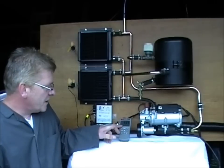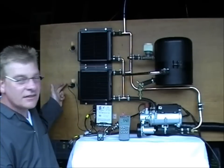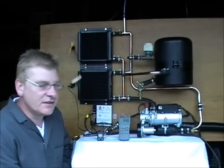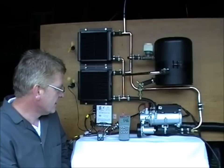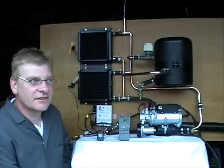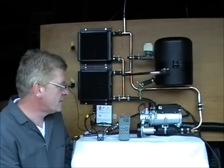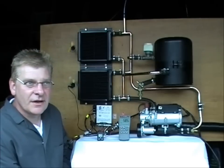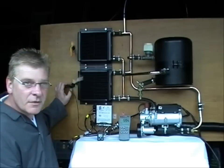You probably can't see this figure, but at the moment we're up to 54 degrees of hot air being sent out in these little heat exchangers. The heater has now gone back into boost just to warm the water back up to around 60 degrees, just over, and then it'll slow down again just to a very low 1 kilowatt, just over 1 to 3 kilowatts of power. There we go, temperature now is up to 59 degrees of hot air, coming up to 60.